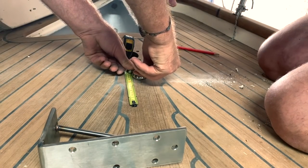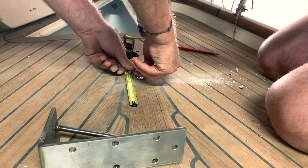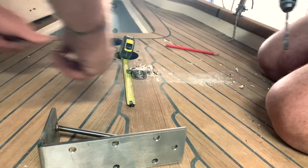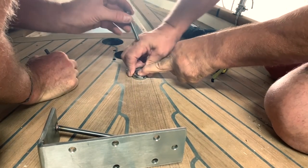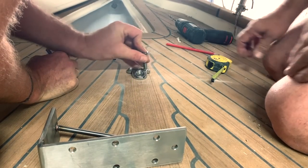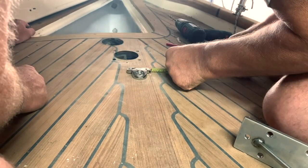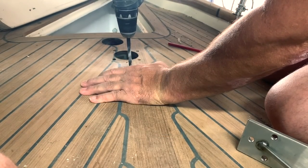You can't do all the perfect work and then mess up the holes. Here's all the work. Now I help Piero position the chain plate and we install the second bolt. Piero checks the measurements another time to be sure the hole is perfect and we start to drill the last hole.